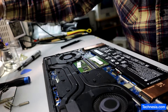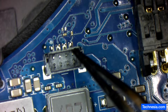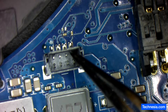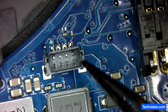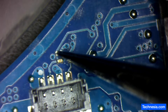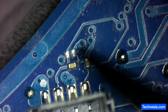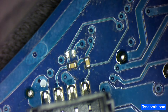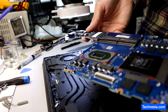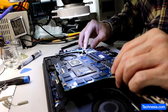Now we know the problem is on the motherboard, not the fan. I'm going to check under the microscope and see if there are any missing or burned components around the fan connector area. Here we go — this is the connector for the CPU fan. I notice a pad that may be missing a component. Let me check my donor board pile to find the same board for comparison. I found a donor board — the exact same board — so let's compare the components around that connector area.